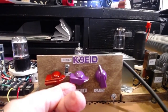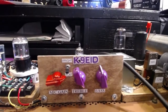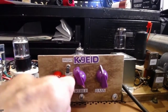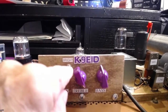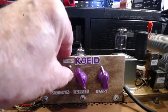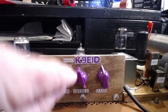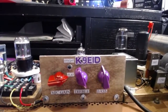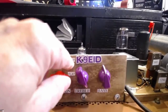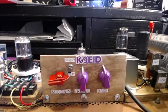If we go back to flat, it sounds nice. But we could have a whole session on how our ears work and why we need equalization in ham radio. Bring that treble back up where your ears are most sensitive. But then I said that's not enough. So I added those parts — a switch and a .001. And it's a bright switch. Right now we are on what I call the flat position. Listen to what happens when I take out the .01 and switch in the .001. It's like, oh my goodness. I didn't change the level — I changed the frequency response. Look how much better you can understand. It's not pretty sounding, but it cuts through. We'll take it back. There it is a little more flat. And there it is flat. And it's wonderful.